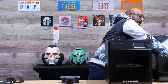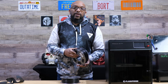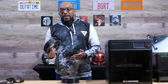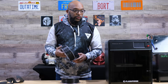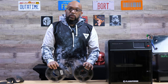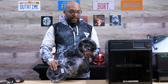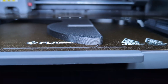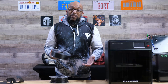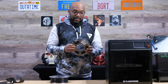The second nylon filament I have is nylon carbon fiber — PA12-CF. They've taken carbon fiber powders and mixed them into the filament, which makes it easier to print and gives it a different texture. But while regular nylon is difficult, the carbon fiber nylon is abrasive as heck. It's really, really rough, so you need a hardened steel nozzle — and preferably hardened steel extruder gears — so the filament doesn't wear them down quickly if you plan on printing with it a lot.